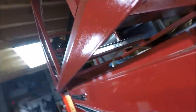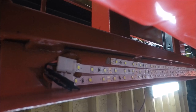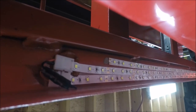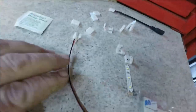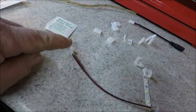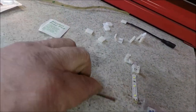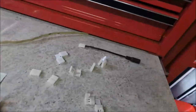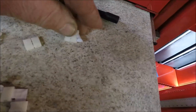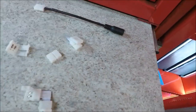Down below here I did a couple of different things. You'll see that there is a connector with a bunch of wires coming out, and then it goes to another connector. What you're looking at is two connectors: the strip comes into this end, and then the other strip came into one just like this, and then I just soldered the ends together — that was one way to do it. On the other end I tried another way and used one of these 90-degree connectors, and I folded it over so it comes in and goes back out. So there are a lot of different possibilities.